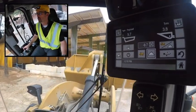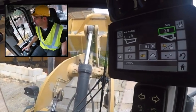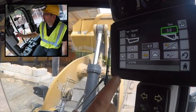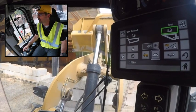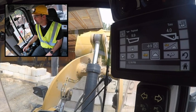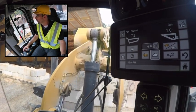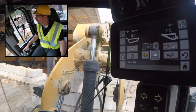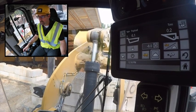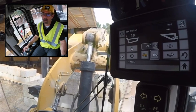I deliver this over to my target and as I approach I lift up the linkage arm right on up through my weight range. I get that green box accuracy confirmation and I'm good to dump. I'm just underneath my target and as I dump I'm looking for confirmation of those asterisks — meaning I'm no longer making a bucket adjustment but actually latching that material into the final truck weight. I dump just far enough and there it is — it latches.